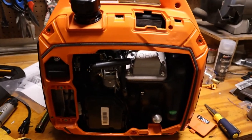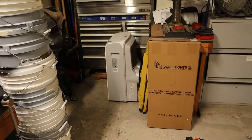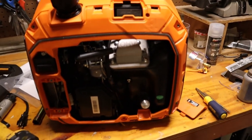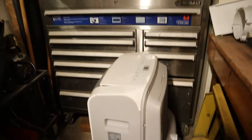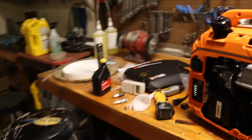It's very quiet. From over in that doorway with the generator running, I measured with my phone less than 60 decibels in eco mode with a light load. Nearly fully loaded running that air conditioner wall unit, it was around 67 decibels, which isn't tragic. This is a 2000 watt generator rated for 1700 running watts, and it was able to start a one-ton AC — pretty incredible. Not many generators can do that. This is a 13,500 BTU air conditioner drawing 11.9 amps, and it was able to start and run it. It struggled a little bit but ran it for a good long while.